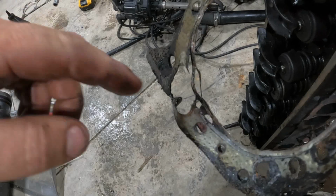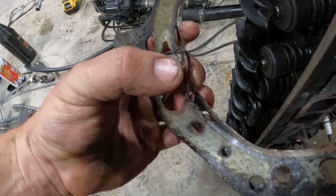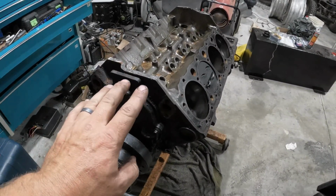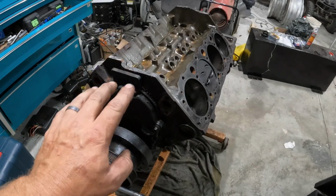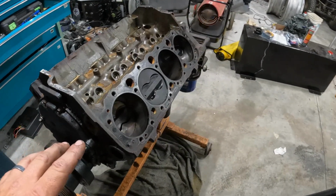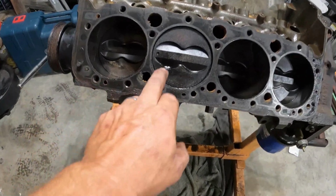You can distinguish a blown head gasket right here. This is blown. This is supposed to be just one piece. I have taken apart three motors that I have here, and my results are completely surprising to me. This motor here was the one that was running in the boat. This is the one that got us on the trailer. What is amazing about this one is it is actually a fairly new reman.